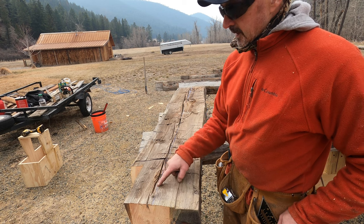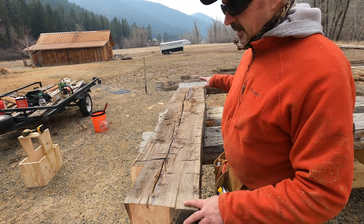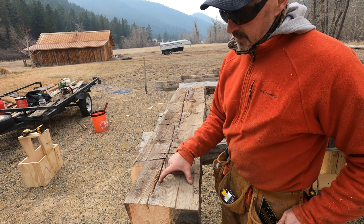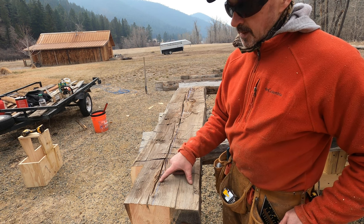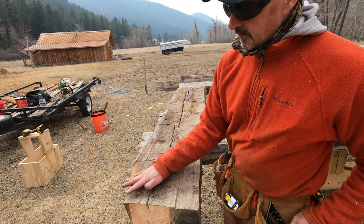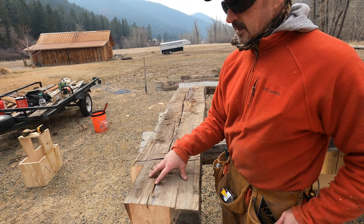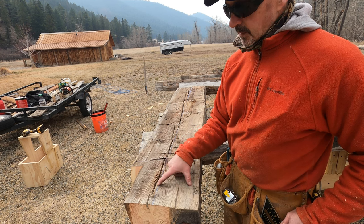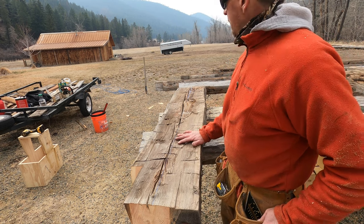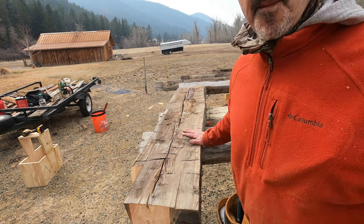And I'm going to offset this chalk line now 5 inches and mill the bottom off of this log and the other bottom course logs, front and back of cabin. And so these will sit directly on the subfloor. Now the two side logs, the base logs, we'll handle those a little differently. So right now I'm just working on the front and back walls and the lowest logs in the cabin. So now I'm going to take them over to the mill and take off the bottom edge here to get a nice flat surface. And we'll do that on the front and back wall first course logs.